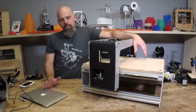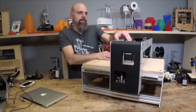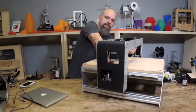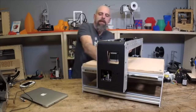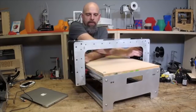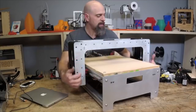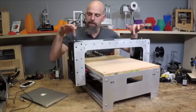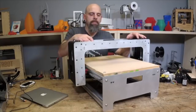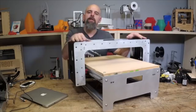I've gone over this in weeks past, so I won't belabor it. This runs on belts on X and Y, and then it runs on dual lead screws on Z, so it goes up and down. It's an interesting design. When you roll it down all the way to the bed where it's cutting material, you can see the bars here and behind here — four bars for Z and two lead screws. They're NEMA 23 motors, so it's pretty powerful, but it does have belts in it. It was strong enough that you could slowly cut aluminum with this.